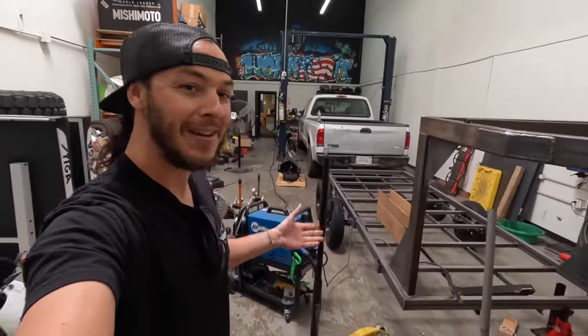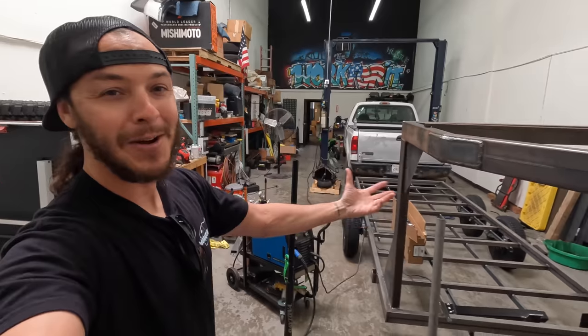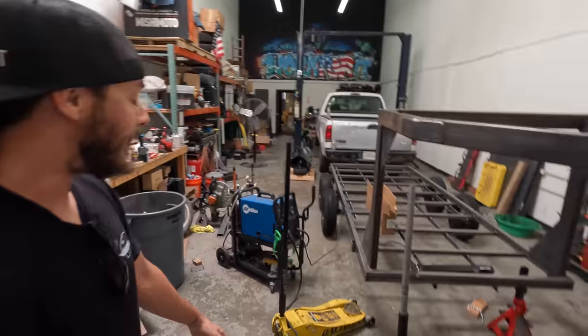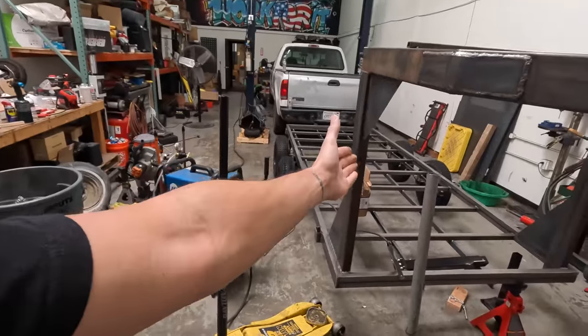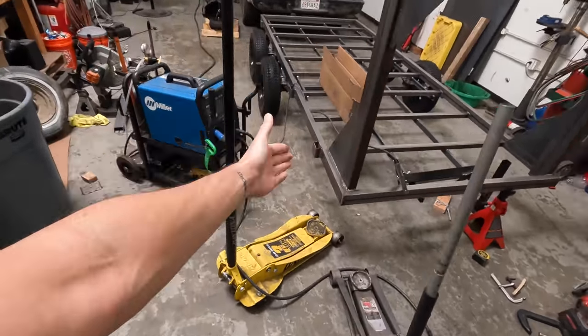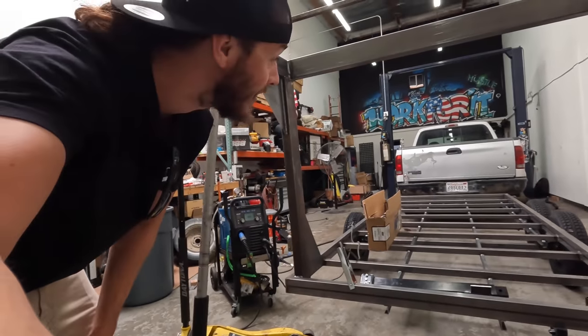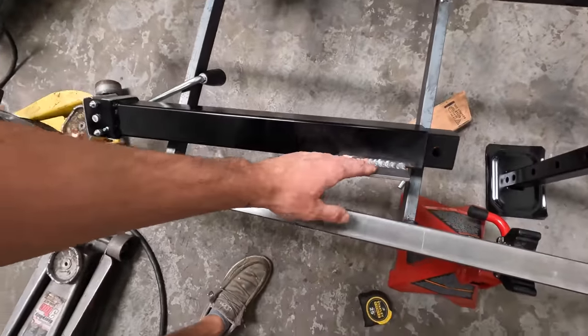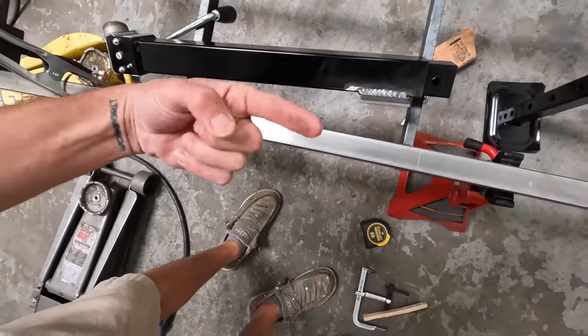So in the last video, and hopefully you guys are watching the series, and if not, go back, check it out and see all the cool stuff that we're doing to this thing and figuring out as we go. But last video, we got our supports in because we realized we should probably beef this thing up a little bit. So we got those running down there. We added our stake pockets. We got a little bit more bracing going on the neck portion here. And then we actually got our tongue jack all nice and welded up. Still need to get that bolted on, but that'll probably be happening in this video.